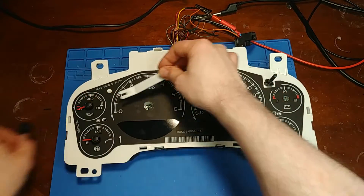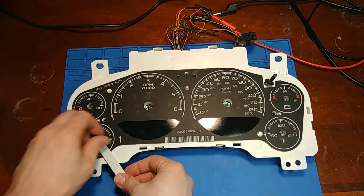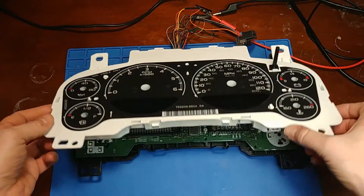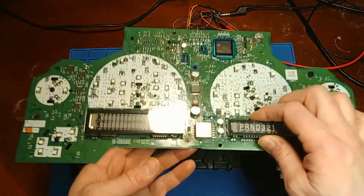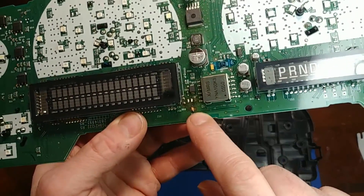This customer sent me pictures beforehand and it's got the typical blown-up MOSFET and damaged foil, because when that component gets too hot it kind of welds itself to the foil and then it gets all ripped up when you try to remove it. That's right in there is what we're going to be dealing with in this video.